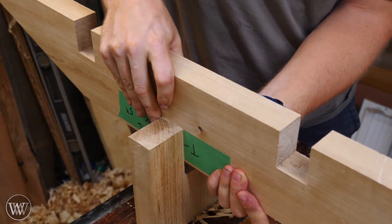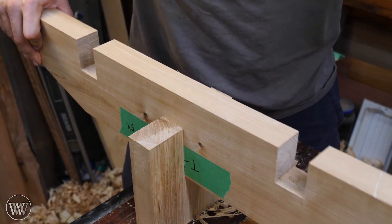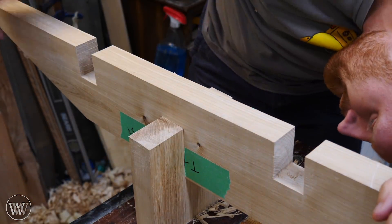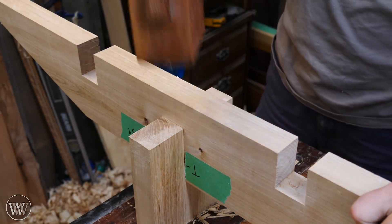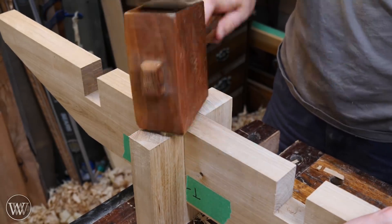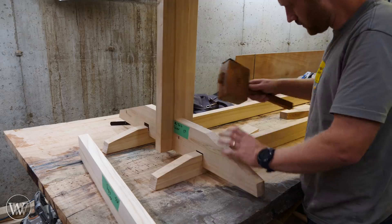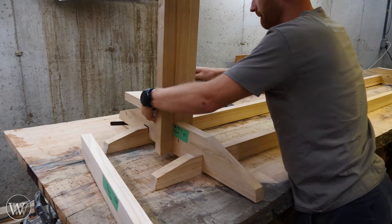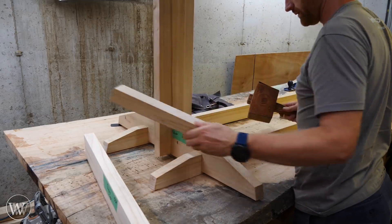I fit it in there and on the first try it actually worked out pretty well. It's a little tighter than it probably should be — I should come back and clean off a little bit — but in the future I'm going to be smoothing out these boards and taking off a little bit of thickness when I do that, so a little extra force needed to drive it in is not a huge issue. Using a soft-faced leather mallet, you can pound it down, and that is one really nice tight joint that is not going to come loose anytime soon. Then we can take it over the table and bang the joinery together — this whole thing will be put together without nails, hardware, or any joinery technique other than gravity itself holding the table base together.